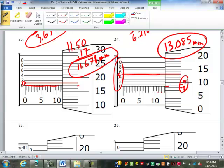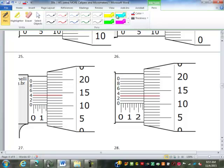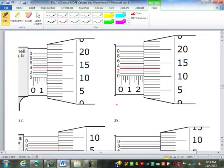You guys have a vernier micrometer? Okay, yours is probably an inch micrometer, though. Like this one, then. So this is 0.150. Then this is between the 10 and 11, but we always take the smaller one, so that's 0.010. So 0.160 right now. Then what lines up here is the 4, so 0.1604 inches.